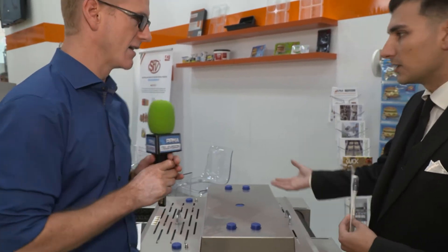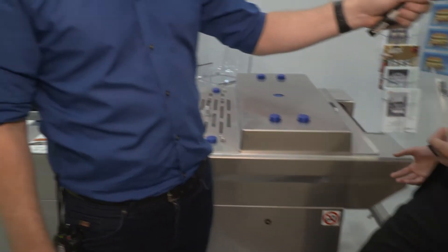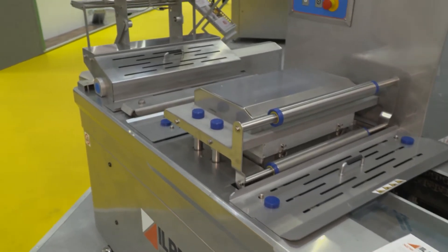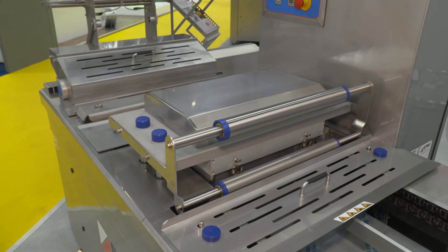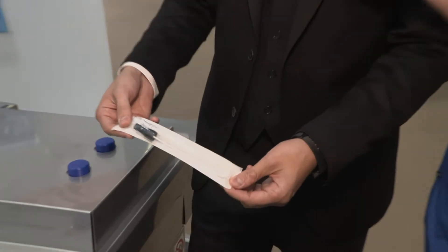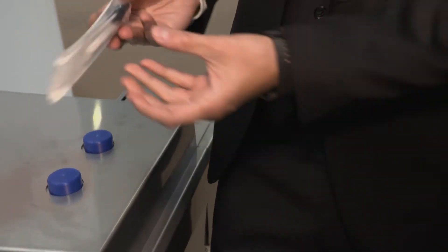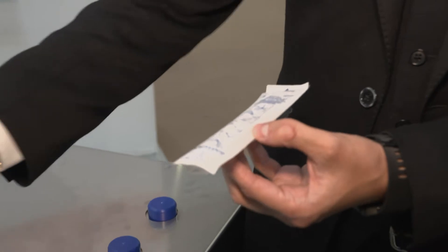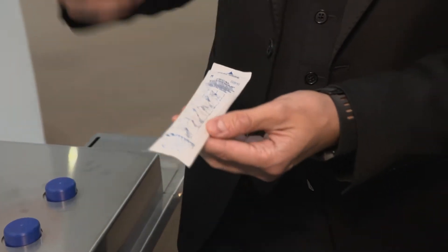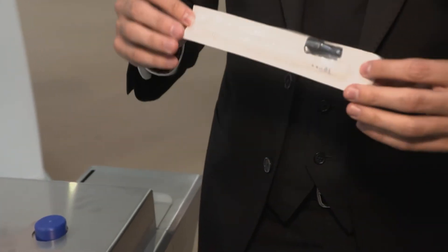This machine is where you have to make the tray yourself, so it comes off a bottom web film — it can be flexible or rigid — and then thermal forms it into the tray size that you want. I have a medical application example here. You thermal form the shape of the product you're going to fill, then an operator manually loads it, or it's loaded automatically via robot, then the machine seals the top. The pack can be vacuumed, gassed, or just sealed only, in a high hygiene environment.